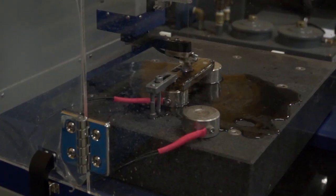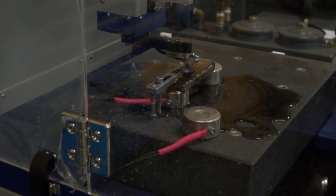Another point is the granite table — that's a good feature rather than having a steel table. Yeah, a lot of the time with EDM drills they have a stainless steel table because of water, but a lot of the time people end up sparking into them. Granite is also much less likely to distort over time than steel might do.